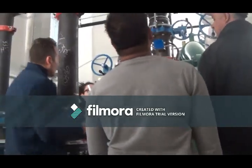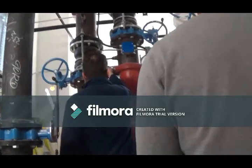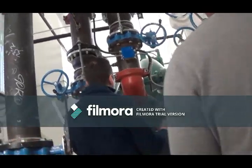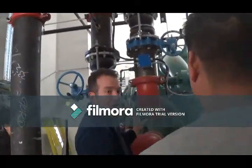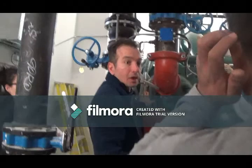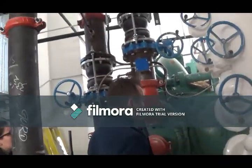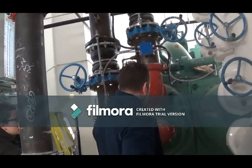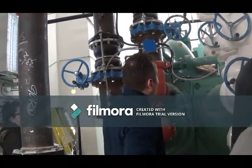They will, I guess, at some point in time, have some gauges on here and here. Again, ask yourself, if you're walking by, if it's a clean system and this says 30 and that says 20, everything's good. If this starts to say 50 and this starts to say 10, there's a problem. Okay. So your gauges are just like a doctor looking at your blood pressure. Again, you're looking for any water around, any abnormal sounds, and so forth.